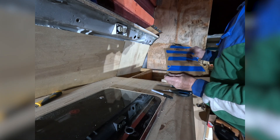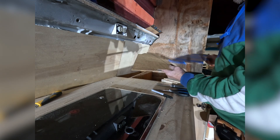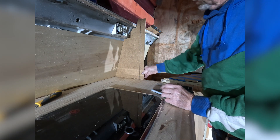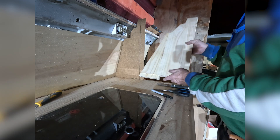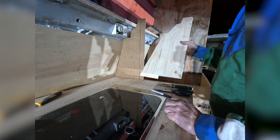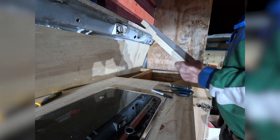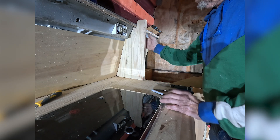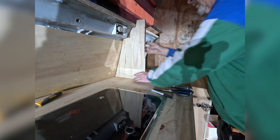The template stock is just hardboard. I traced it on there, made it where I wanted it to end, cut that to fit pretty close. Once I was happy with that, I got some leftover cutoffs from all the boards I'm using for shelving tops, put it on there, cut it out with a jigsaw, and then made it flush. Now we just gotta figure out how we want to attach it.